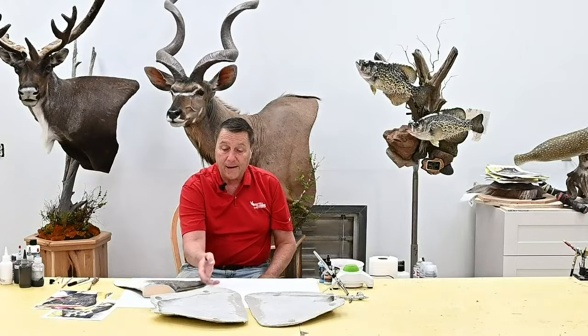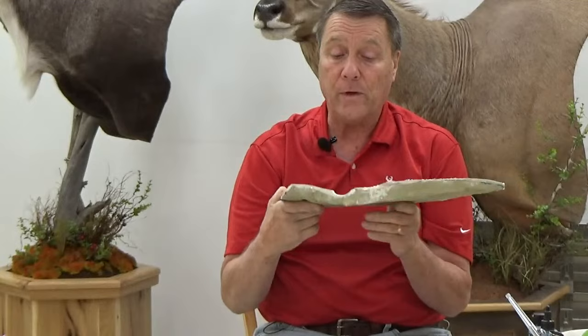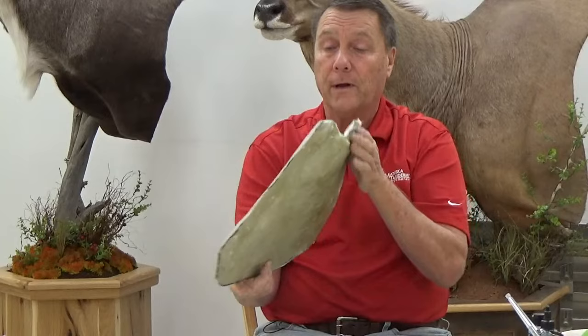That's our mold. From that, we waxed and buffed this. We put a PVA separator, polyvinyl alcohol, and then we painted on super poly casting plastic. On one side, we painted it, painted the other side, put the two together, poured some in here, a couple cups in here, and rotated it around.